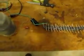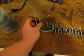I'm not going to trust that choke against these diodes in my bridge. So if you put a 1.5 amp load between your bridge and the charging of the capacitor, every time you have a short, you will either light a light bulb, and if the short remains shorted, the light bulb will remain lit, or you continue to produce hydrogen. You fix the short, and you get what I'm saying.